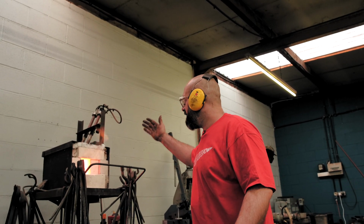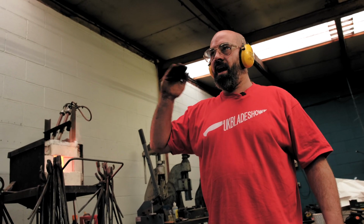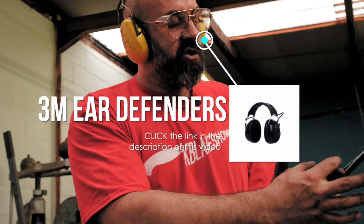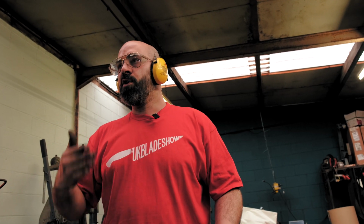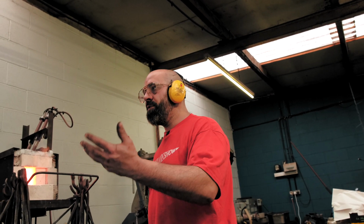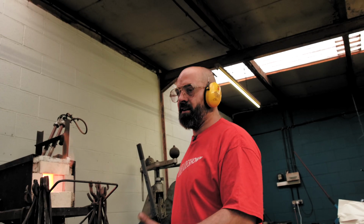So what you want is, you want it to be too hot because you want those grains to expand, and that helps with the weld boundary. As the two bits of metal, as the grain expands, it expands across the boundary that you've stuck these two pieces of metal together. And you can refine that again. I mean, you can go too far, you can keep it too hot for too long and it's more difficult to refine, but there are ways, thermal cycling and refining the grain structure. I mean, even smashing it with a hammer will actually help break up carbides and keep the grain structure good.